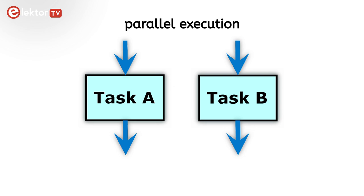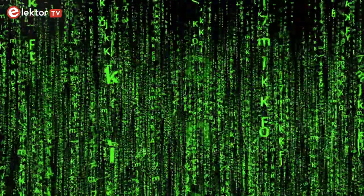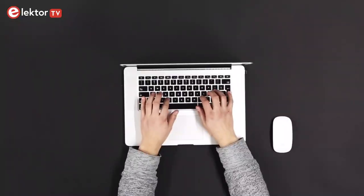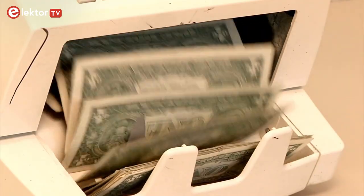Another reason not to use two cores is communication between cores. The cores must exchange data. If core A takes care of the system's serial port and core B wants to use it, it must pass through core A to send or receive data. If the protocol is simple, core B might as well talk directly to the serial port instead of a middleman. On the other hand, two cores can be practical when an application can be divided into two main tasks running almost independently — for example, an audio or video streaming application where one core decodes the data stream while the other handles user interaction. But such a system would probably work equally well on two separate microcontrollers, so two cores are hard to justify except maybe for cost reasons.